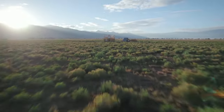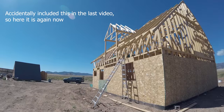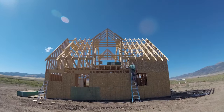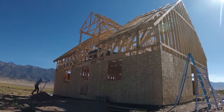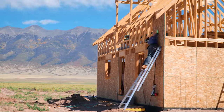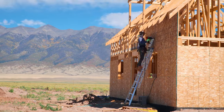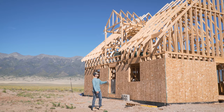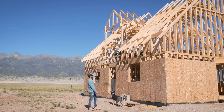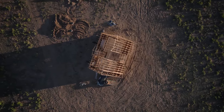So where we're going to kick off is with the eaves. They're all too long — they need to be trimmed back and made vertical on the end. I'll trim them up with a string line and a level, and then I'm also going to sheathe up to the heel of the truss, just so that I'm locking everything together. Then it's filling in the gaps between the trusses. Over where the stairs are going to be, there's an opening because there had to be a gap in the trusses for the stairs to come up — that's a three and a half foot opening. And then I have a big gaping hole right in the middle between the dormers that'll need to be framed out so that we can accept the sheathing.